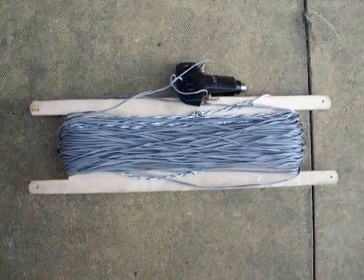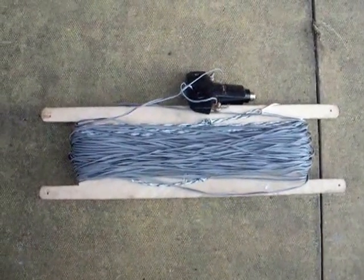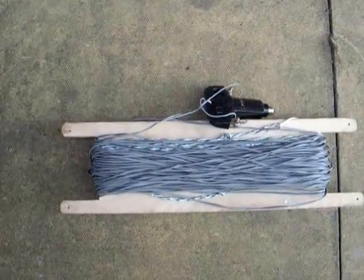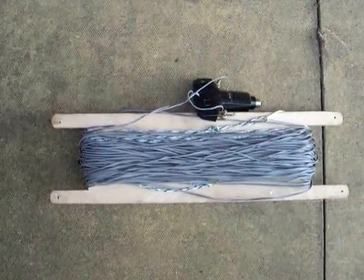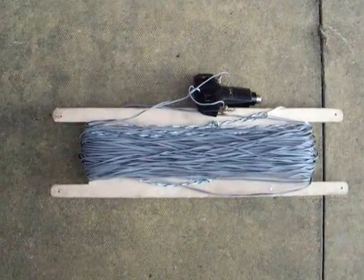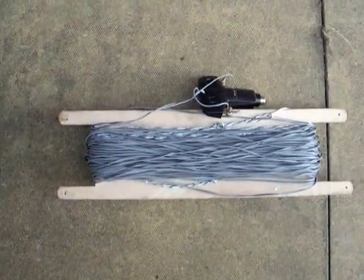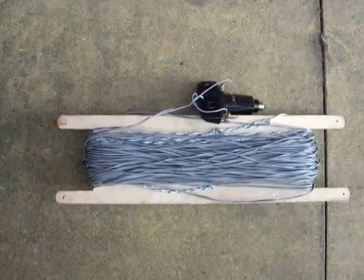Right, here is an 80-metre doublet made up, and on the bottom is a 1-to-1 balun. Not strictly necessary, you could go straight into the matching unit. I suggest you still use some sort of matching unit so that you can make the 80-metre doublet go on 40 and 20, and indeed of course you have that all important earth resistor to take the static off of the aerial.